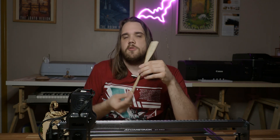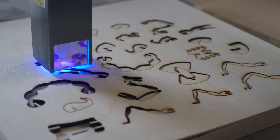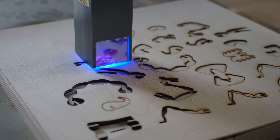For other cutting jobs, I tried a few things. I did a very simple spatula design just to test how quickly I could cut something out in a few passes, but I noticed it was charring a little more than I wanted. For other test results, I tried something where cutting and assembly were involved. I did a small wooden insect puzzle, which provided the opportunity to really test how quickly I could cut between many multi-piece projects and whether there would be charring. With the X7 Pro, it's a good idea if you're not using an air assist to potentially increase the laser's travel speed between different parts if you want to avoid charring.